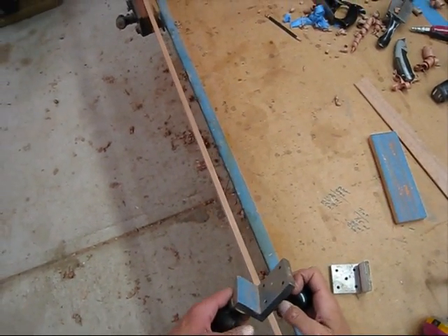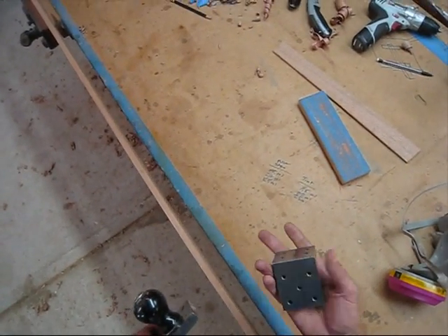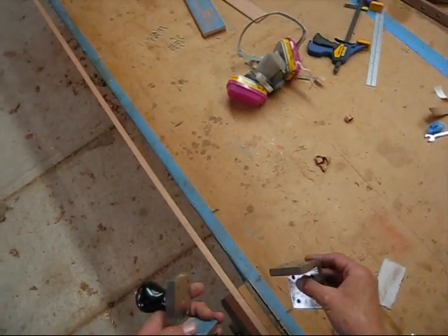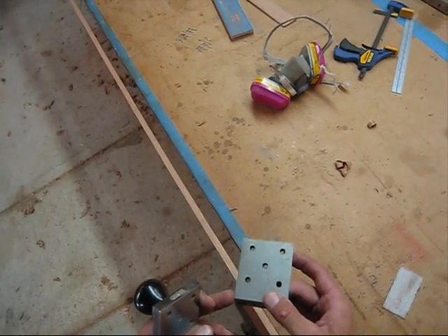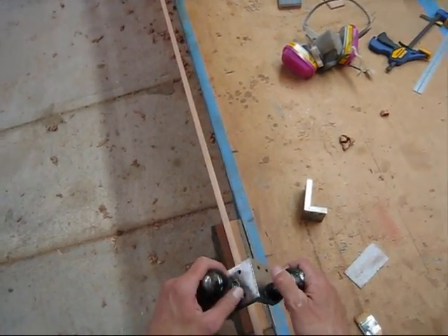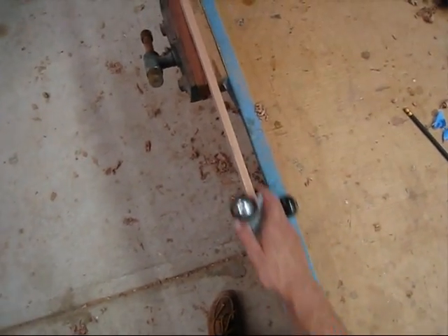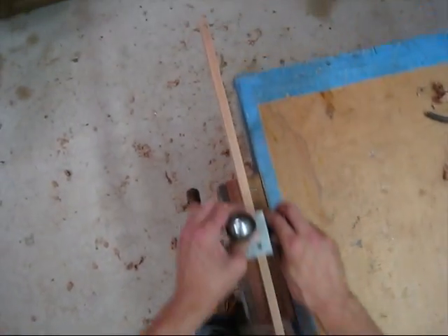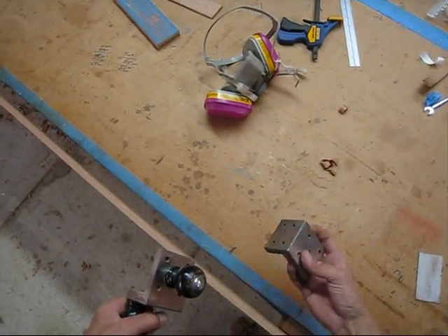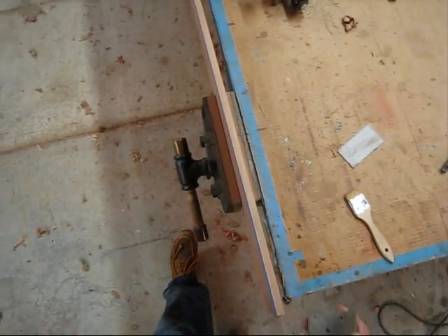I'm going to shoot one more clip on that 90-degree sanding block. I've been using this all day and it's really worked out nice. I remembered I had another one in the box, so I took it out and mounted some 80 grit to it, so now I have a 40 and 80 grit and I don't have to keep switching back and forth. I also noticed that these holes are threaded — they're 5/16 thread — so I took apart an old hand plane and cut a couple of carriage bolts, and now I have handles on this. You can still hold it like this if you want, but you can use the handles too. If you happen to find any of these or you know a machinist, you can get a set of these, put the handles on with the sandpaper, and it just helps you keep that edge at 90 degrees.